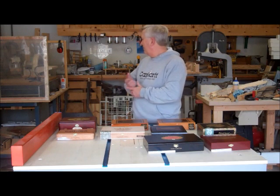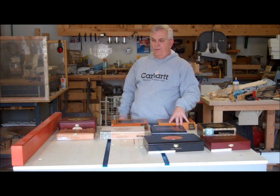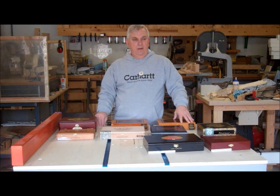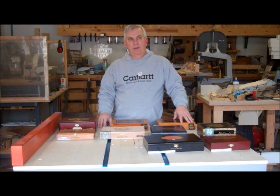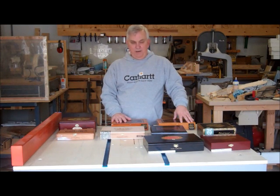I'm going to use my CNC router over here to cut the neck and the fretboard. I found a nice fretboard calculator online and used that to get the exact dimensions for where the frets go. I'm going to use the CNC router to basically just mark the location of the frets using a little V-bit — just put a slight groove — and then I'll come back with a fret saw and put the frets in. I'll keep the video rolling and update you on the progress.